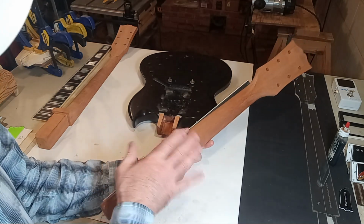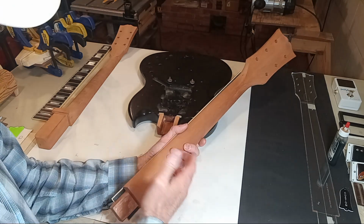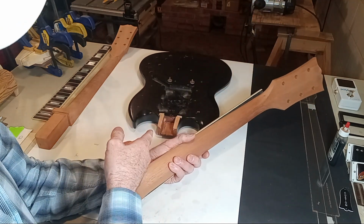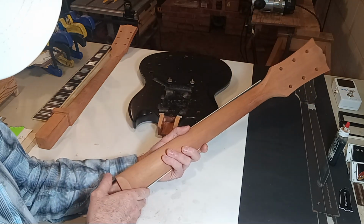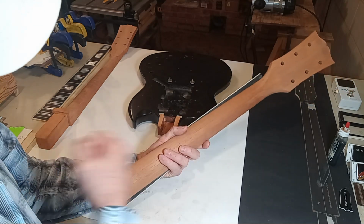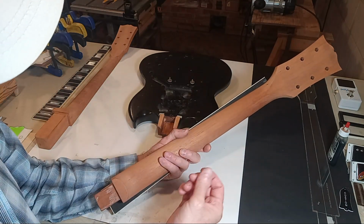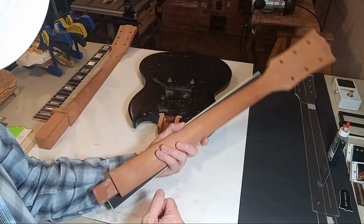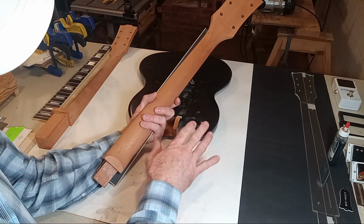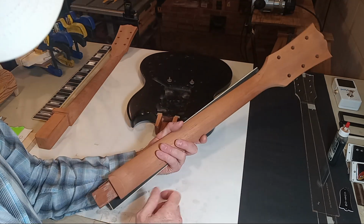And don't worry if you miss your color a little bit. If you get lucky and match them up on the front end, that's awesome. And I think really dark colors are much easier to work with by far than light colors. But I would say don't go in too dark, because if you go in too dark, even if you're just doing clear coats atop that, it will get just ever so slightly darker. So when I'm doing my stain work, I'm going to try to hit a target of about 80 to 85% within that color, which is just about black right in here. So I should be fairly safe.